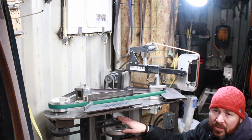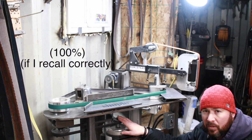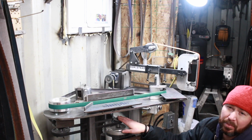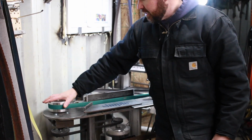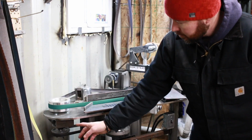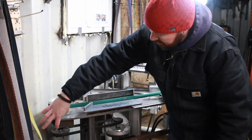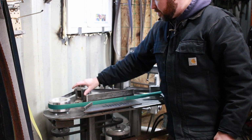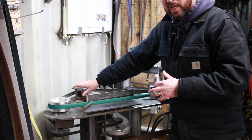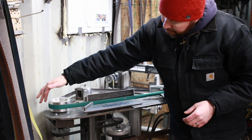So I've got 50% speed reduction, which incidentally also gives you a 50% power increase, so a 1 horsepower is plenty enough to drive this grinder. My drive wheel is a 5-inch, and again I've just got that mounted on a 3/4-inch shaft. I've got 2 flange bearings spaced out with a piece of C-channel here to give it some rigidity, and then I've got my homemade tensioner / tracking device and my crowned idler wheel, and again my drive wheel is crowned as well.